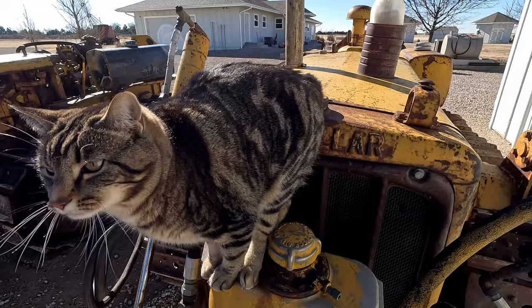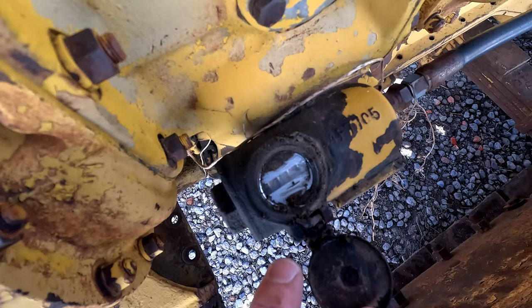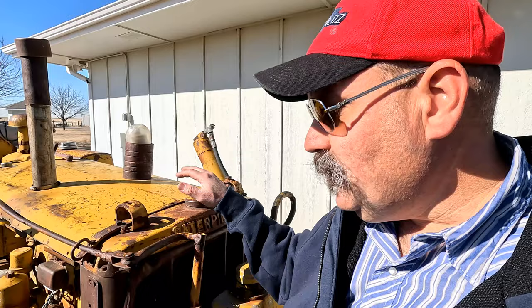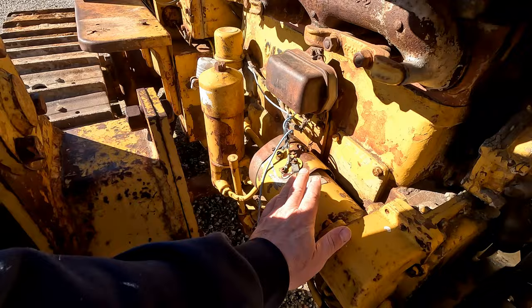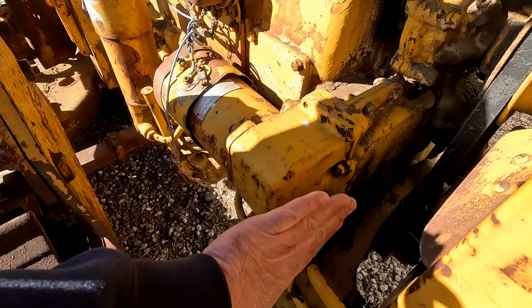The hour meter, I have not even looked at, so let's clean it off. Nearest I can tell, this hour meter looks like it says 2,892, which it's probably rolled over, so it's probably 12,892. I've noticed on some of the newer 6 and 7U's, they've actually switched to a five-digit service meter. This one is indeed equipped with the generator system, and this is a different style than on the earlier 5T, 4G, 7J series tractors, because it has a whole separate flange that bolts on this intermediate front cover and the front cover for a generator. That does look like something that started in these older 5T machines.